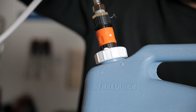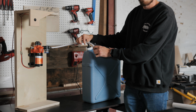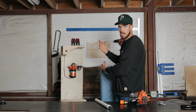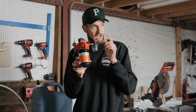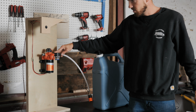Then you're gonna want this connection here, which is gonna thread, that's a 3/4 garden hose connection up to a 1/2-inch pipe connection. So this is your faucet line. You can use any length of those, but I have one linked in the description. We use about 20-inch, normally works for underneath our cabinets. But again, you might need different lengths. And the 1/2-inch is also gonna go directly into this strainer, which comes with the pump. So that's all hooked up here, you can see.